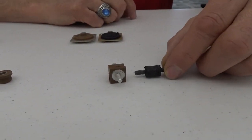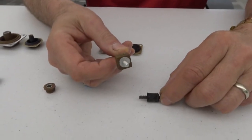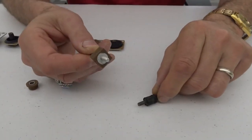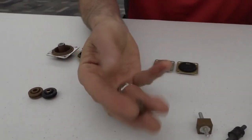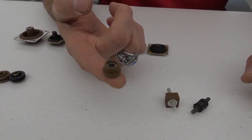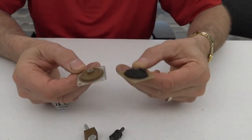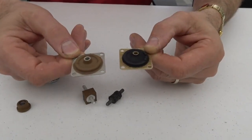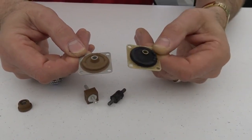These silicone and natural rubber parts can be made in various shapes and sizes. This is a silicone sandwich mount square used in an aerospace application. This is a natural rubber part used in industrial applications — very highly damped natural rubber versus very low damped material. Here are two plate-form 100 series size mounts: the black rubber is natural rubber and the brown is silicone. Even though they are dimensionally interchangeable, the silicone is going to have very different performance versus the natural rubber.